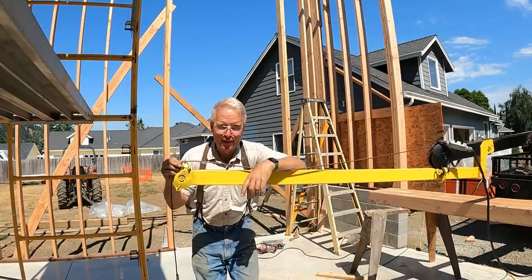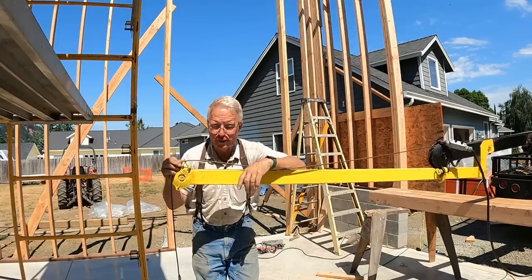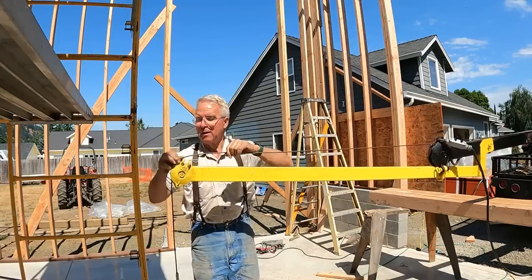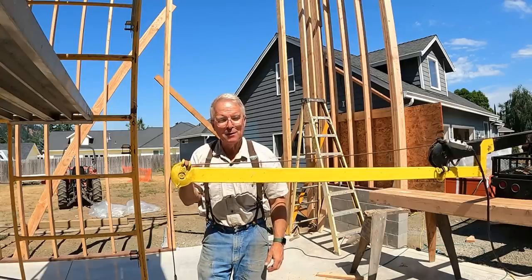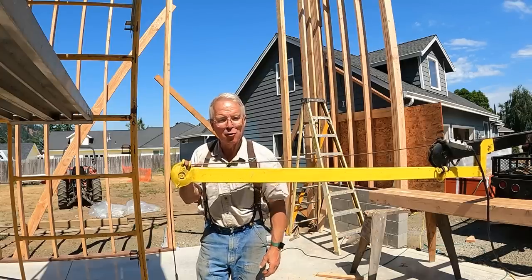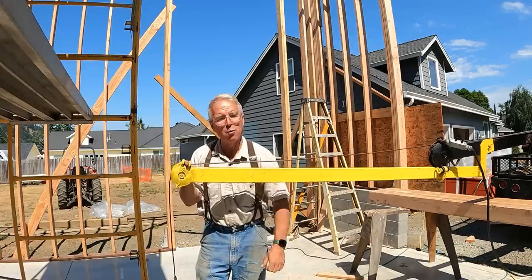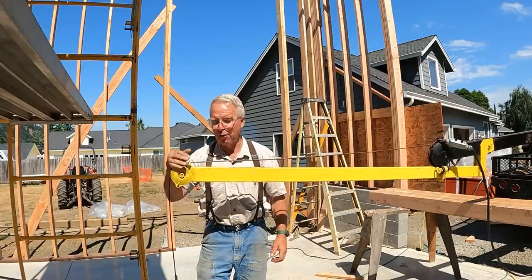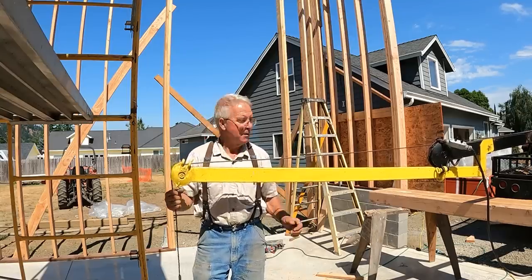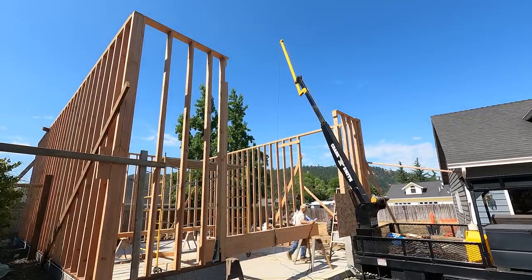Having said that, there's one egregious safety violation that I'm gonna be going with right now, and that's this. I don't have a bale over the top of this line in this little pulley. The only thing that's holding it there is gravity. And so I have to always remember, if there's any kind of a failure or a whip or anything that interrupts the steady bearing of the load across the top of this snatch block, somebody needs to get out of the way. Here we go.